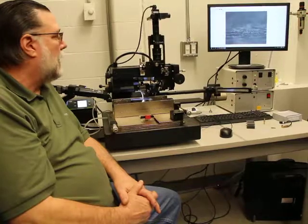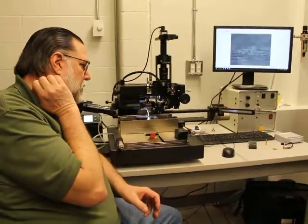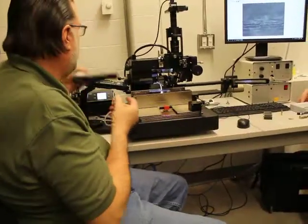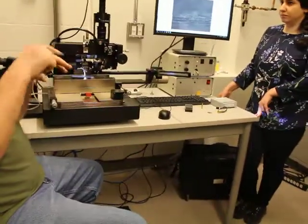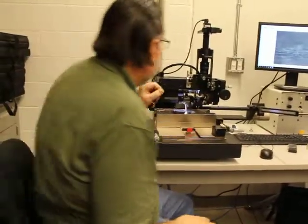So all this also depends on the pressure. I'm wondering how much, because if it's very viscous and the needle is small, then it will be... Right. In the program you can adjust your pressure and time and all that kind of stuff. Basically this dispenser is a time-pressure dispenser. It's not like some of the auger types.